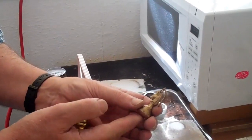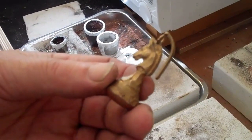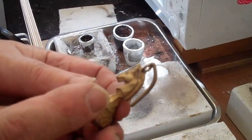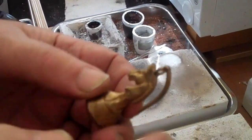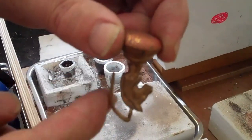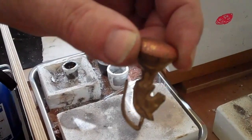In the micro foundry you'll perhaps recognize one of the charms that we've been casting using gravity casting. These little charms come out nicely because they're a fairly simple shape and it's easy to vent, casting in this way — easy to vent the air from the bottom up towards the input, in towards the in-gate.